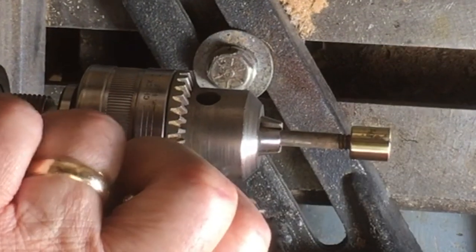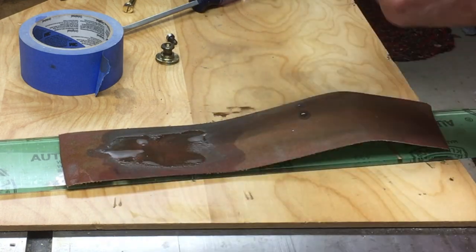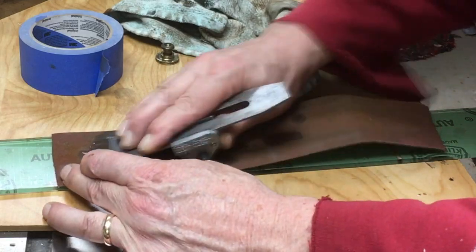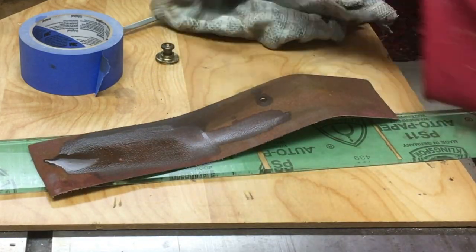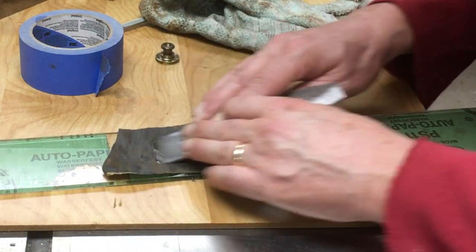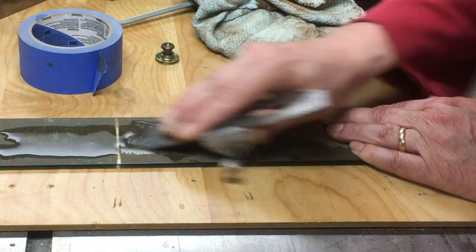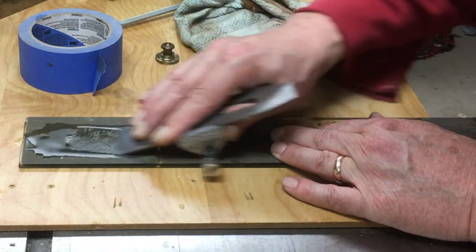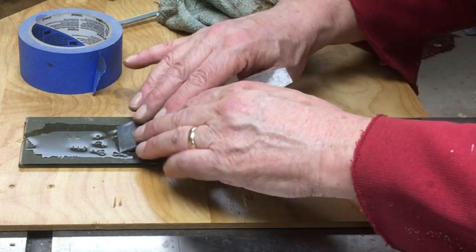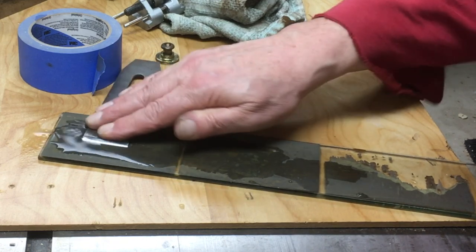The screws and brass parts polish up very nicely. For sharpening, I find that sandpaper works pretty well. This blade was pretty close. I put marks on it with a Sharpie so I can tell if I have my bevel angle correct. I'm using 220 paper, then 400 paper, going a little bit further to polish that bevel. Then on a piece of glass I've got auto paper — I think 2000 and 3000. After the 3000 polishing, it's almost mirror-like on the bevel. I flip it over and flatten any burr off the backside, and I've got a pretty sharp blade.